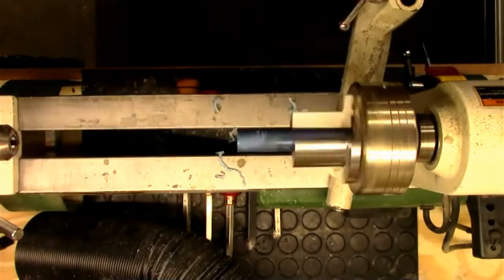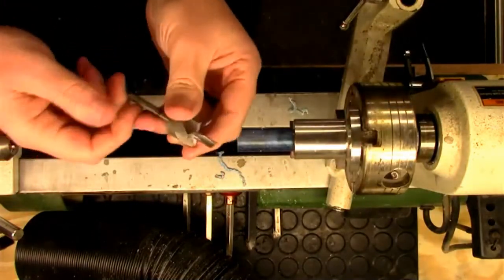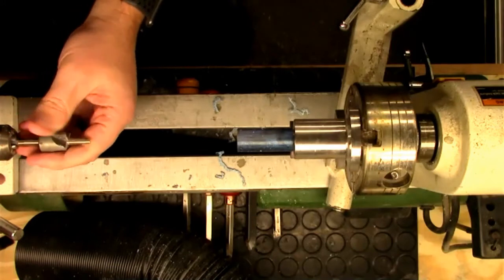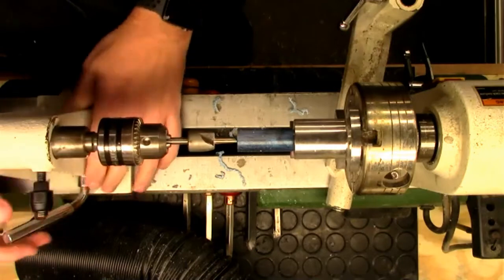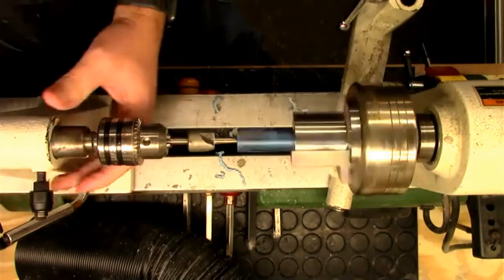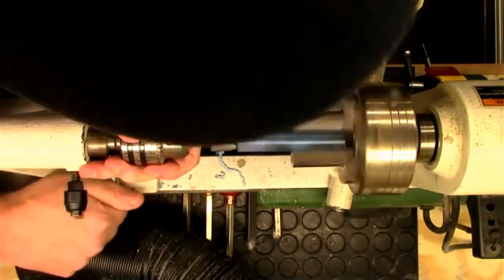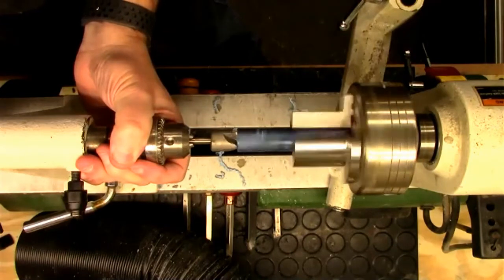And what I do from this point is I use a barrel trimmer. Make sure that's on camera. Okay. I use a barrel trimmer and I put that in my chuck because this end that I'm drilling is not square. It was cut on the bandsaw, but it's almost square. But I need to make sure that it's perfectly square. So what I want to do is ease that up there very carefully, lock it down, and all I want to do is just take a few shavings off.